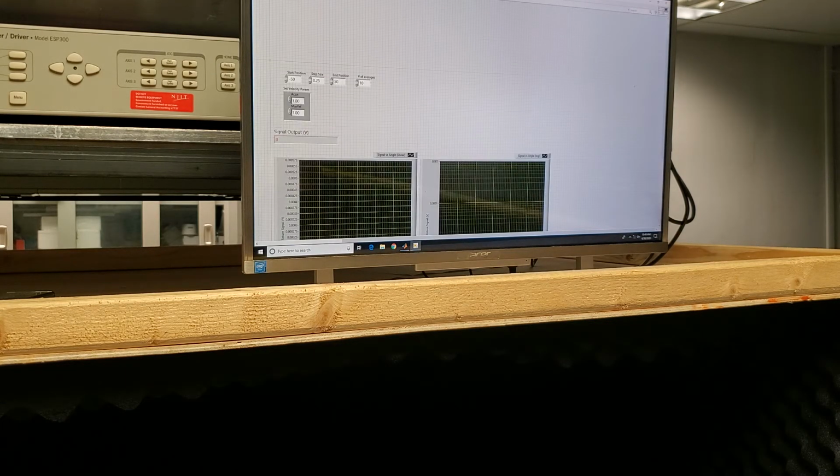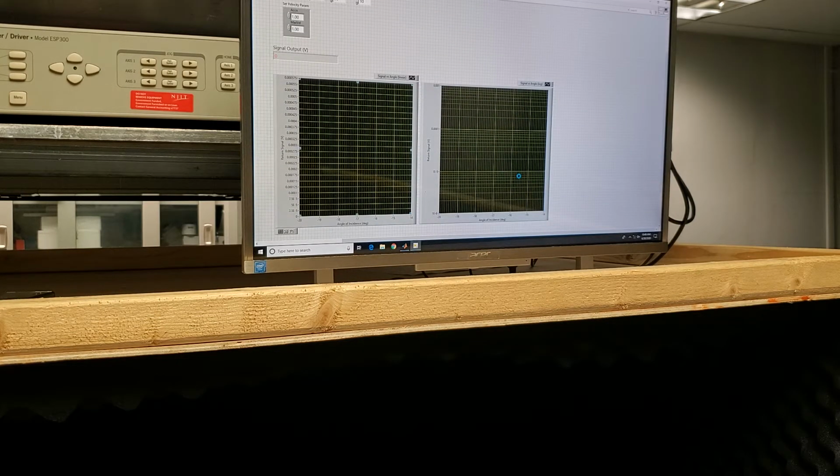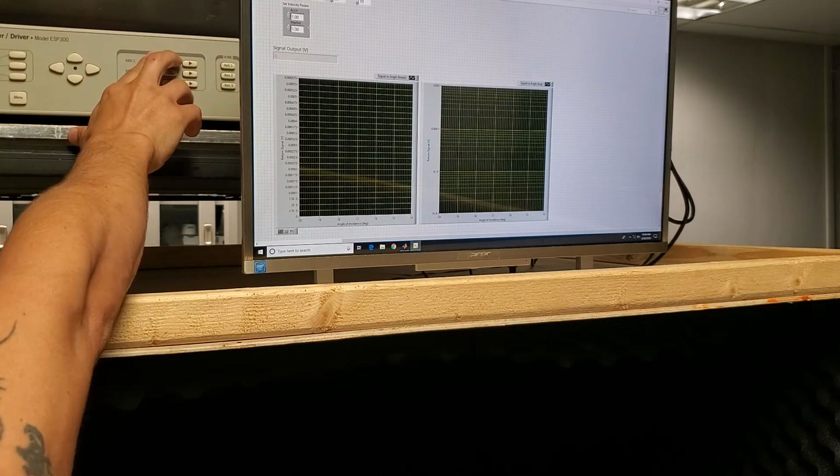You're going to scroll down here so that you see both the graphs. One's a log plot, one's a standard plot, and now you have icons you can change: start position, step size, end position, number of averages, acceleration, and max velocity. What you should do is, once you load in your sample, find where the peak is roughly for your return signal.